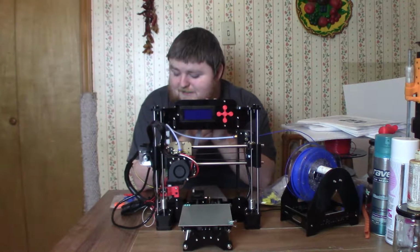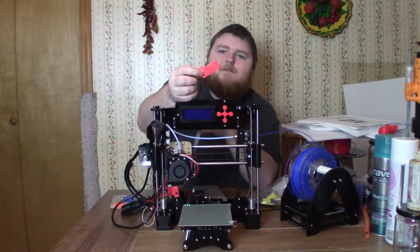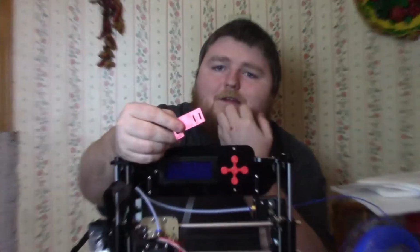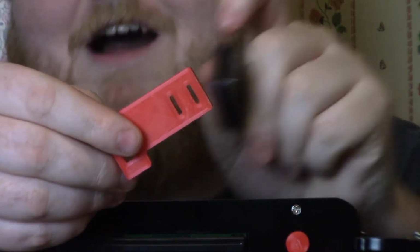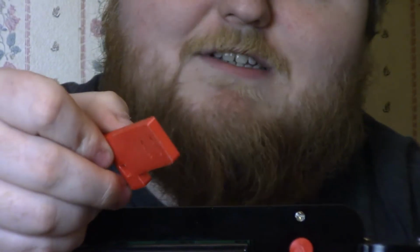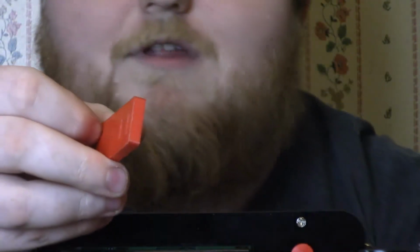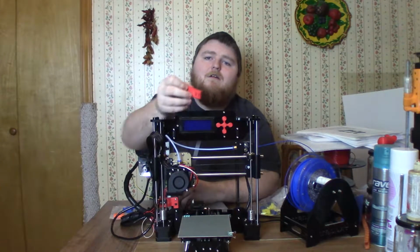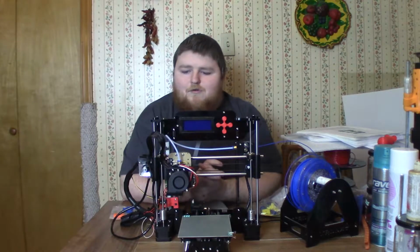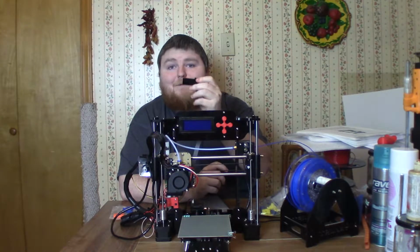Now, keep in mind what I said earlier about this part, because here was my first test print on trying to replace that part. Now remember, I said that this part is a bit thicker than all the other acrylic, and that with the limit switch it was too thick for the screws. My assumption was that the piece is too thick. Let me scale it down to around the width of this other acrylic, and it should work. The screws will be able to go through to the nut, and all will be fine and dandy. No. Oh, the cruel irony is that, yes, you do need a thick piece. In fact, it would actually be better if this was a bit thicker.